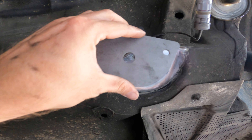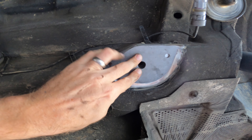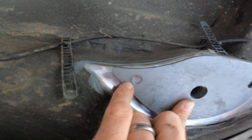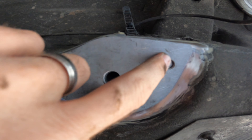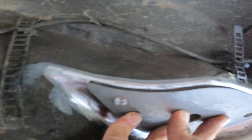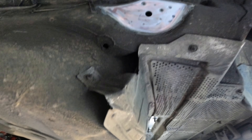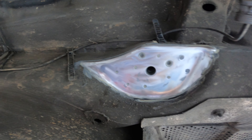The metal is now prepped. This is the particular plate that goes here — we'll put the bolt in, leave it in place, and burn a couple rosette welds, or plug welds, right here. Then we'll start burning the weld around the side. I'd recommend also applying some weld-through primer on this — we don't want this to rust.